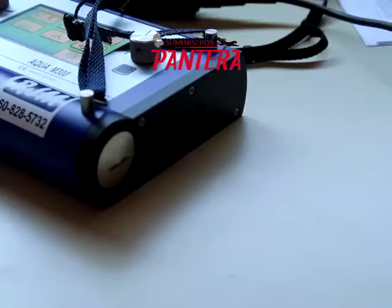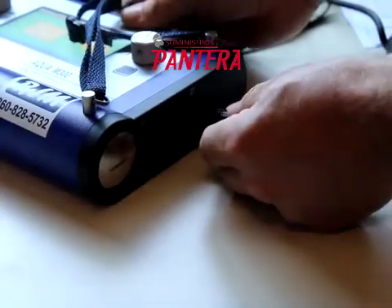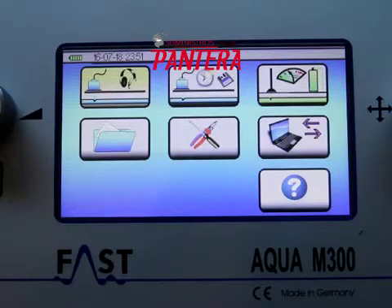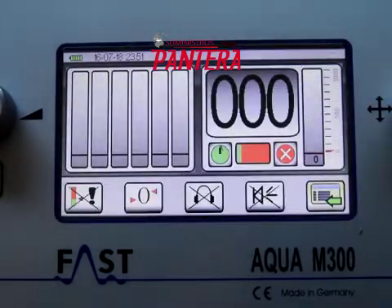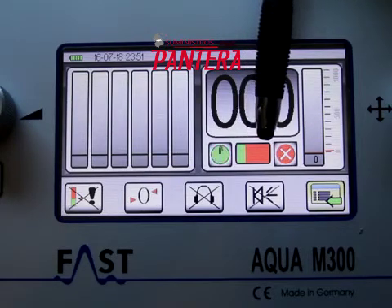The gas sensor and pump are connected at this connector on the right side. Enter the tracer gas detection mode by selecting this icon. When the tracer gas mode begins, it will warm up. As the warm-up progresses, this green bar will progress across until it's all green.